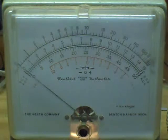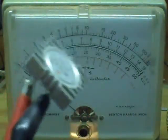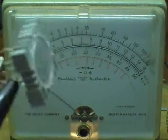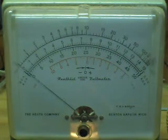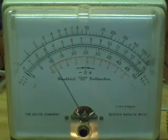In this device under test we have an aluminum-case bridge rectifier salvaged out of a stereo, originally used on about a 50 to 60 volt rail-to-rail application. I could look up the part number, but it's just easier hooking up to this and turning up the voltage: 100, 200, 300, 400 — and it tops out at about 350 volts, brick wall.